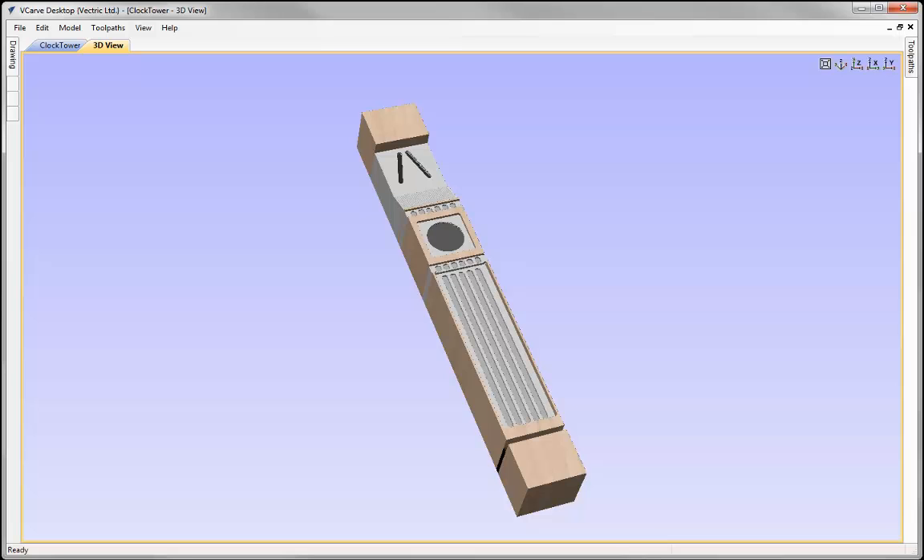In this tutorial, we are going to quickly walk through the process of cutting a full-sided part out just using 2D, 2.5D toolpaths. We will start by looking at the pocket jig to hold our block of material in place, ensuring that we keep our part in line every time we turn the block of material over 90 degrees to cut the next side. We will be creating the part using just one tool, an 1/8 inch end mill.